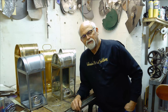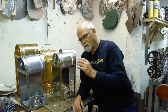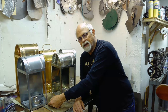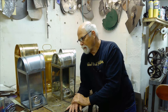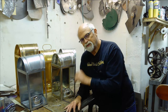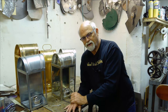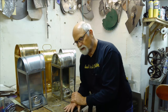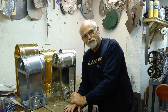The next episode is going to be the detail work. We have to make the doors, put the glass clips on the inside, and put the feet on the bottom — all time-consuming things, but it's got to be done. We are getting pretty close to finishing these lanterns. Then we have to polish them and spray paint them with varnish. The final step is glass and electrification. I hope you enjoyed this episode — looking forward to seeing you soon. Bye!